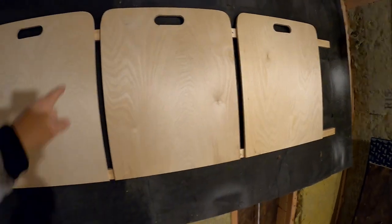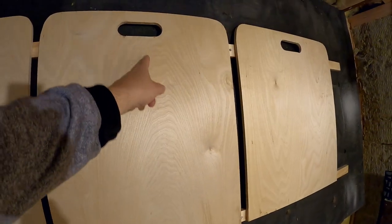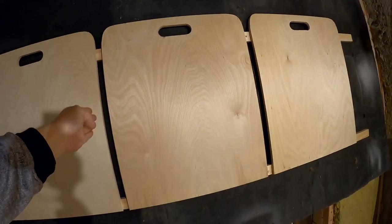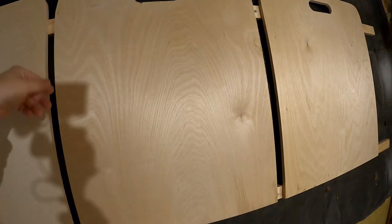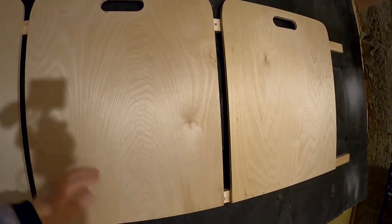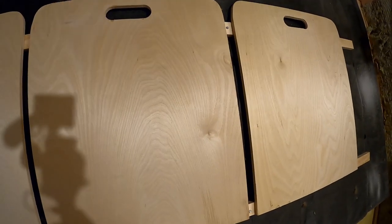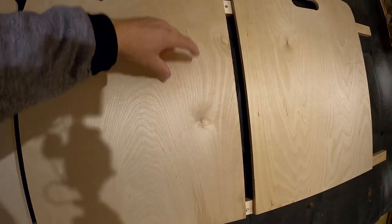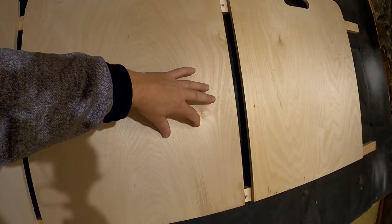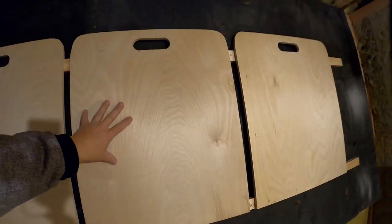The second one, we're going to do the same thing — perimeter track — but we're going to do a mid-wall seam. Fabric is going to come in a maximum of a 66 inch width from almost any vendor, so you're most likely going to have some sort of seam or mid-wall, or maybe you want to use that as a design element itself. We're also going to do a flushed-in grill, as if you had a speaker here in your wall that you wanted to cover with a grill but still have it serviceable.